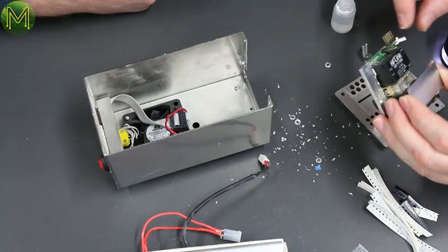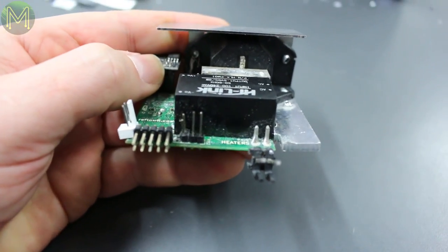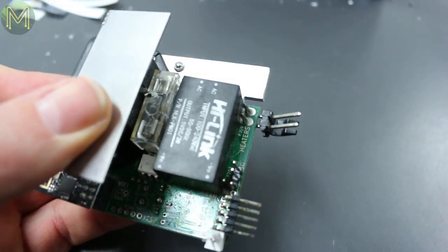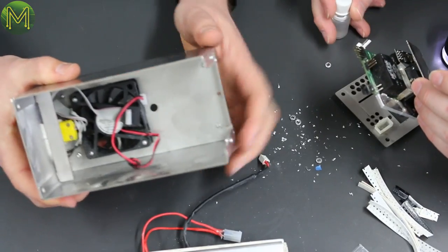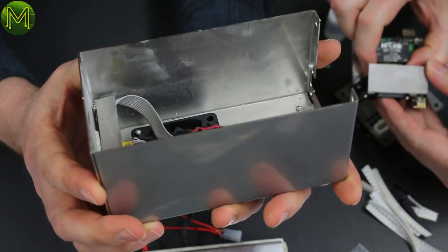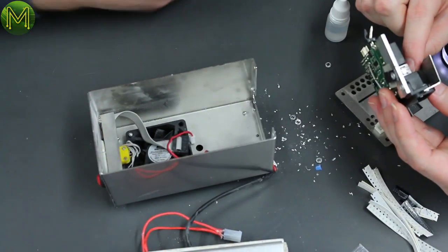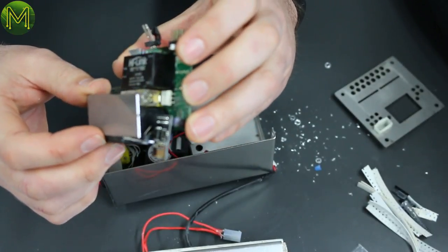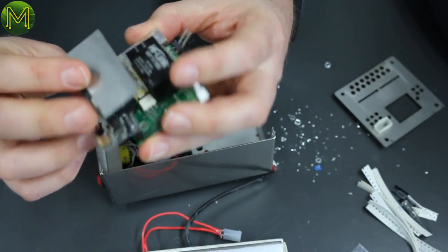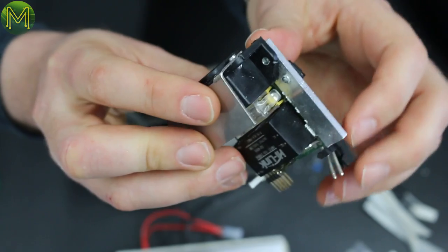The connector, he's really squeezed things together a little bit, like the bodgy connectors coming off at angles. And I think he's really tried to make it as compact as possible. Yeah, I mean, there's actually plenty of space in here. Apart from the fact that there's no way you can probably get that fuse cover off to replace the fuse. You'd have to cut it off because of that earth pin. Yeah, and also, pop riveting into plastic is always a bit dodgy. It can crack it. Yeah, it has actually cracked. You can see it's cracked there and in some other places.